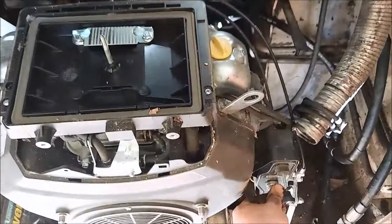It'll be all right. Okay, so what I noticed first was the drive shaft was poking almost out the bottom of the, we call it a universal joint. So that tells me that set screw wasn't loose, but there was enough play somehow for that to happen, which caused that to come off the shaft, and that force blew apart our universal joint.